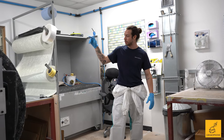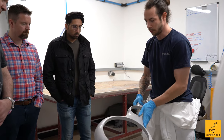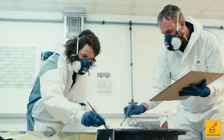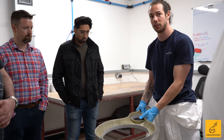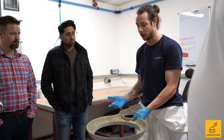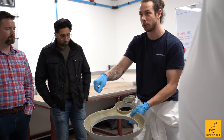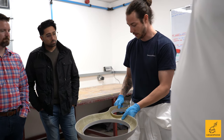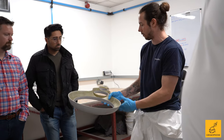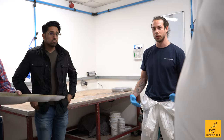Tuesday, we make a front. We've got the front mould there, and here's an example of the front. With fiberglass, it always starts with gel coat — that's the first thing we apply. It's like a thick gloss paint, applied by brush, two coats. Then we start laminating inside, cutting various pieces. We get a polyester resin, catalyze it with organic peroxide, and start laying it up, wetting it out with rollers and brushes, rolling out all the air. You don't want any air because that can lead to cavities. And that's an example piece — that's very strong and weighs absolutely nothing. That's pretty much all of Tuesday taken up making the front.